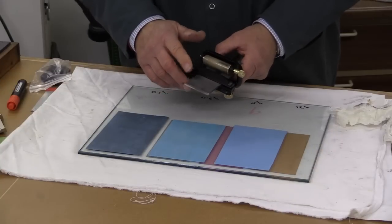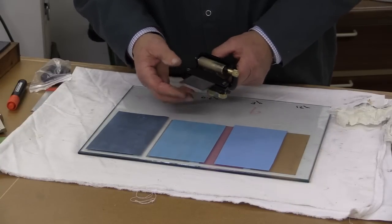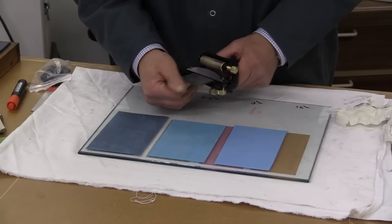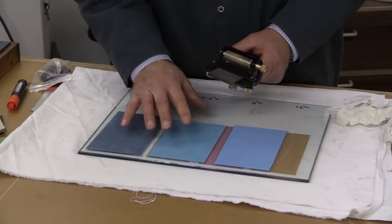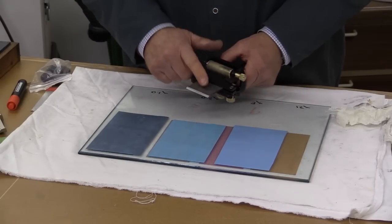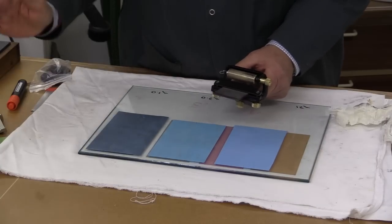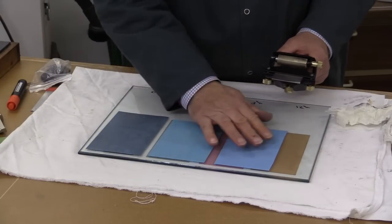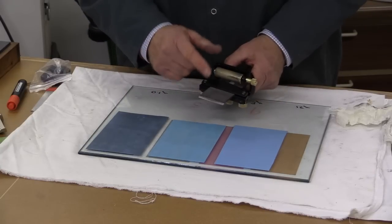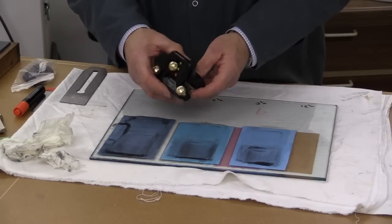It's interesting, the blade from the record plane, it was in pretty sorry state. But I've taken it to the oil stone, got it up to a reasonable primary bevel, and now I can take it to the Axminster lapping film. Now, once you've got the primary bevel done on your oil stone the very first time, you should never need to go back to your oil stone. You should only ever need, in future, to go to your lapping film, unless you have some sort of accident with the blade itself.